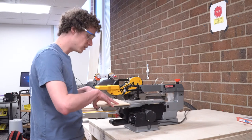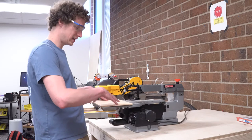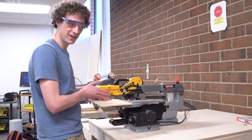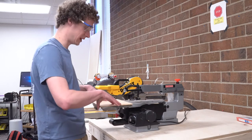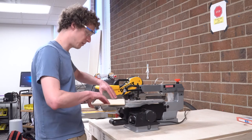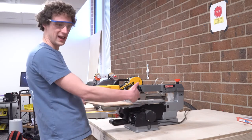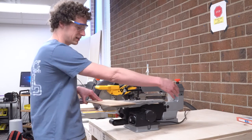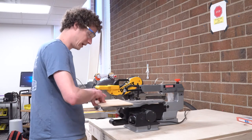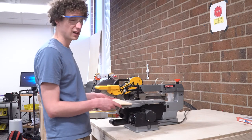The next most important thing is to protect your fingers as you're cutting. As you're maneuvering your material into the blade, keep your hands so that they aren't in the line of cutting with the blade. You'll notice that when I cut, I'll keep my hands far to the side, and when I'm moving it around, there's no chance my hands can slip and go into the blade. If they slip from here, they're going to go that way. The last thing you want is to be pushing on something and have your hand fly into the blade — it's just going to hurt a lot.